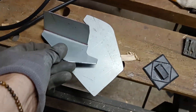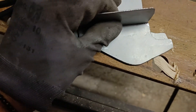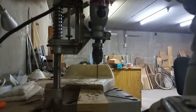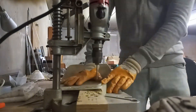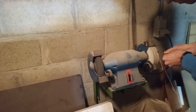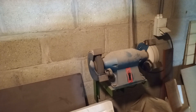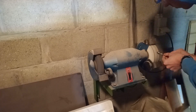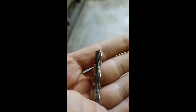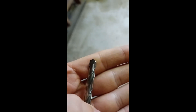You can see the difference here between the left and the right side. While it's very unlikely that they will end up identical, you can see that the difference is quite large. I started on drilling through the stainless, but because of the drill bit being quite blunt, this took ages. So I'm gonna try sharpening the drill bit — I've never done this before, but I hope it will speed up the process. It took me a couple of tries, but I eventually got a nice point on it. Not too shabby. I filmed this in the wrong orientation like a complete noob, but at least the drilling went a bit quicker.